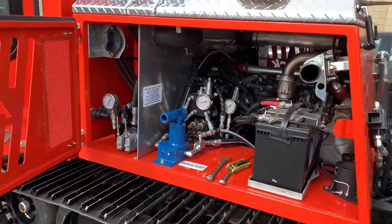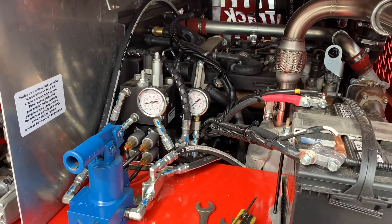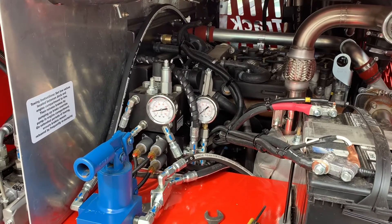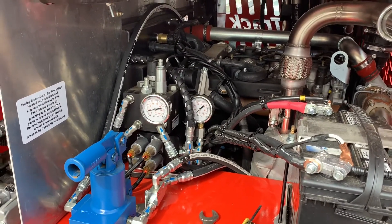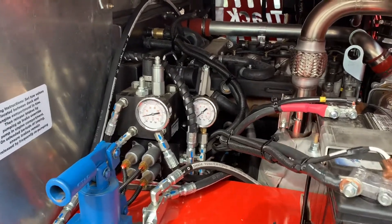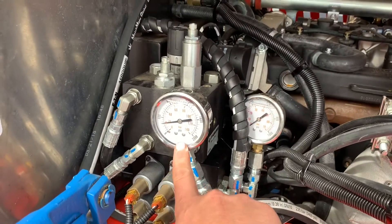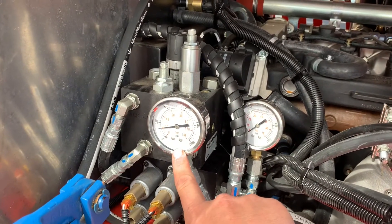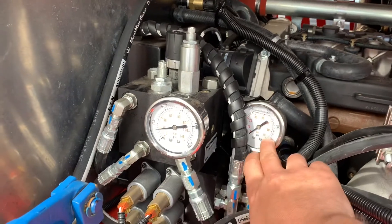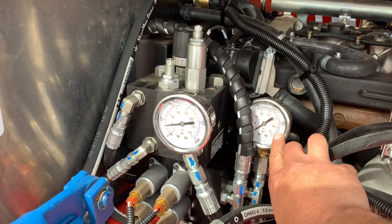As you can see on this unit, I've opened up the driver's side of the engine compartment. Depending on the model and configuration of your AT20 or AT50 vehicle, the track tension adjustment may be located in a different spot, but it will be the same valve. This here is the pressure gauge for the track tension adjustment block. The one mounted back here on this model is actually charged pressure, so disregard that for this procedure.